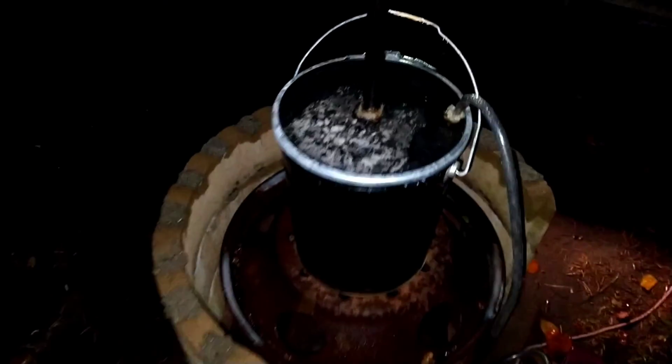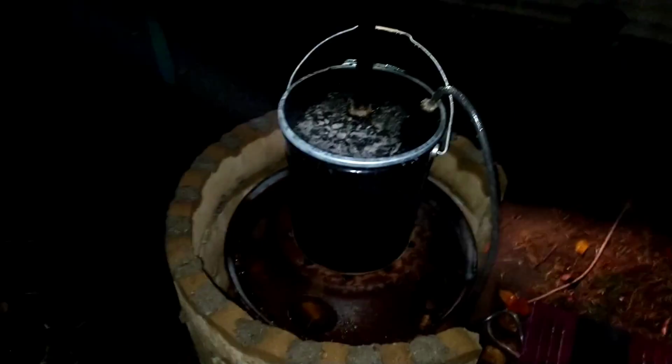And it's kind of cool that this can turn into a steam generator without adding any additional water. It's just the water from the wood. As you saw earlier when I was spraying it on there, there's quite a bit of moisture. Now the water filtration should capture some of that moisture and bring the temperature down of the smoke itself. What I'm trying to make is syngas, wood gas, with this method. It might fail, but I think I'm on the right track with what I saw earlier.